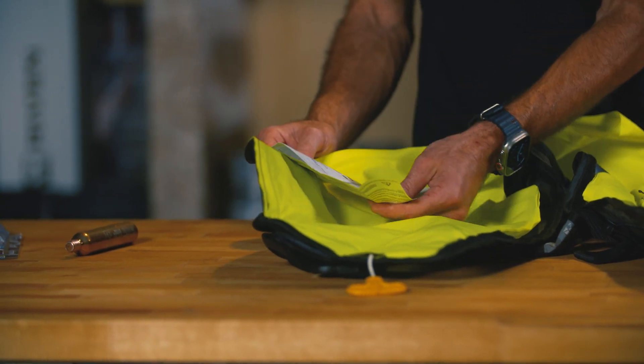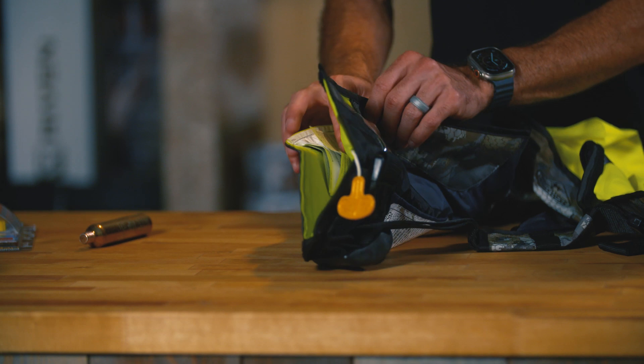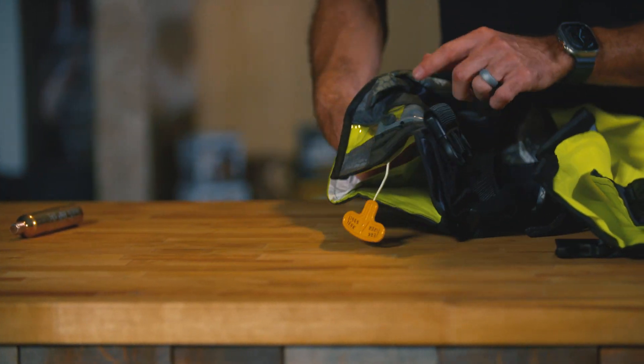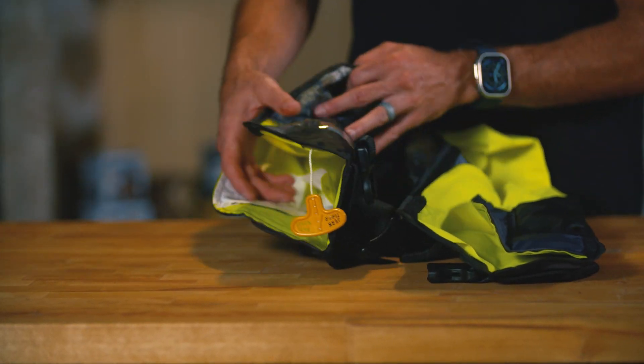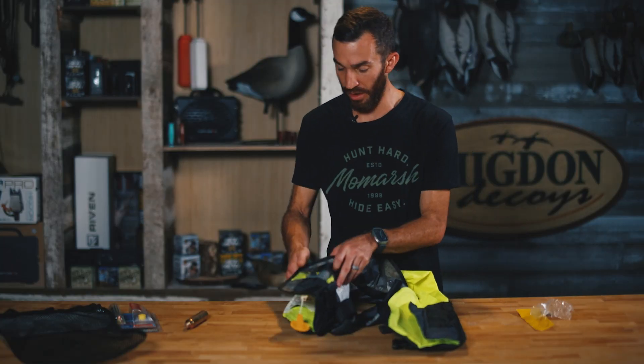The top side of this cap is made to depress this mechanism to not damage the PFDs. There are some nice instructions here on the right side if you need help. What we're going to do is access this mechanism — attached to the pull cord on the bottom right of the PFD is this gray mechanism. It's got an indicator: red means it's not armed, green means armed.